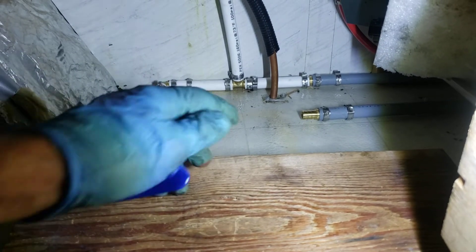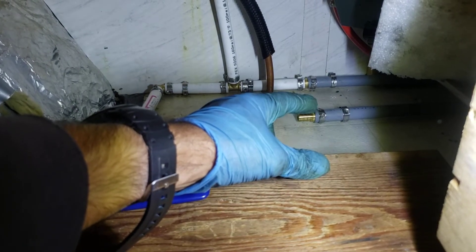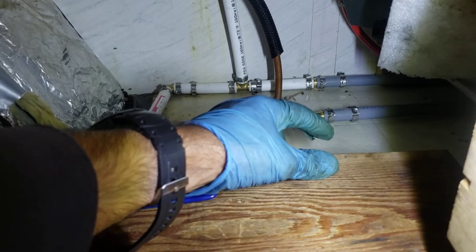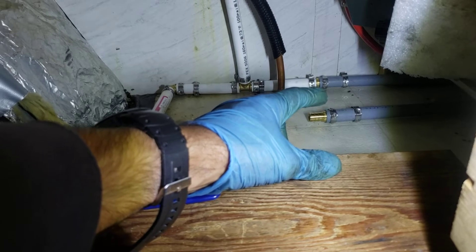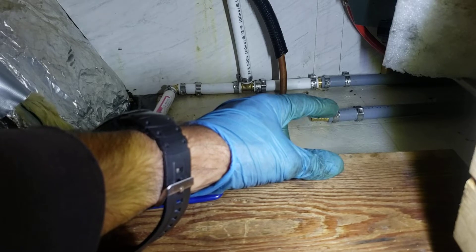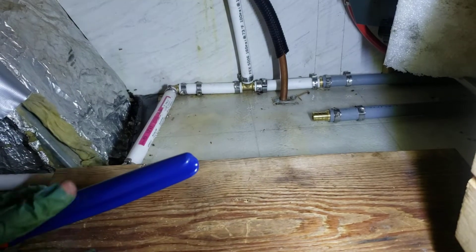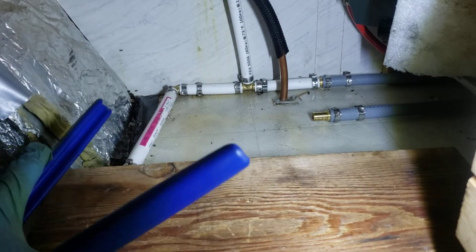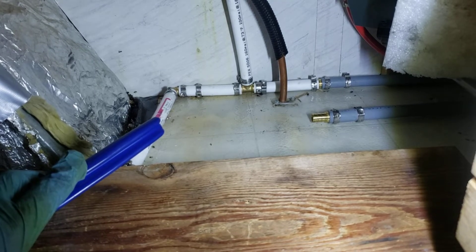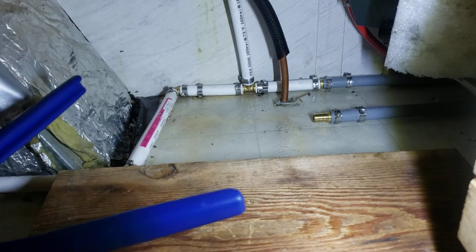Another note: be careful when you put these clamps on — you want them to go on as straight and evenly around the pipe as possible. It can be easy for the clamp to move when you fit the tool, especially in a tight location where you can't see well. You could try putting some duct tape on it so it doesn't move, but I didn't want to risk deforming the clamp and it not making a good circular seal all the way around.